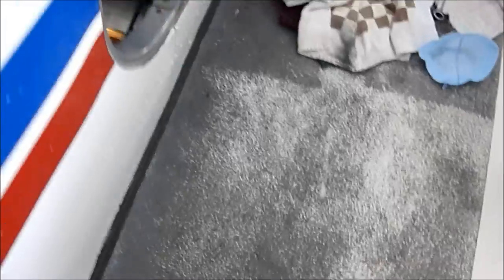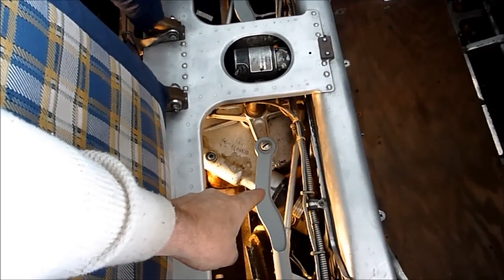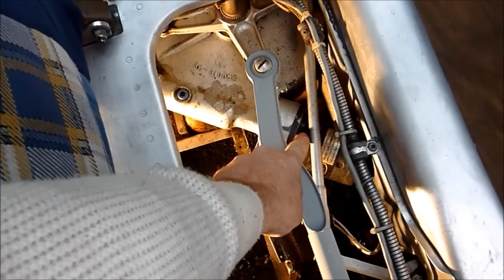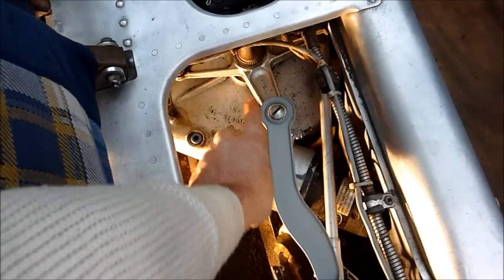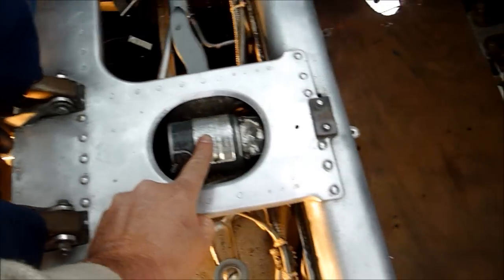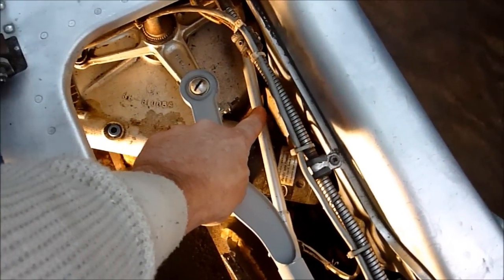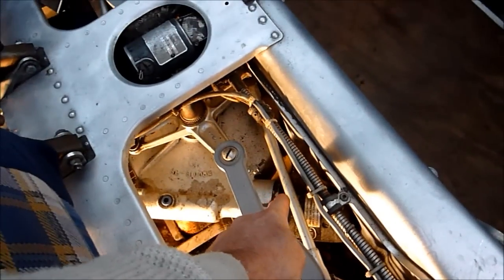Any time you're working on a plane on jacks, you want to be very careful when getting up and down off of the airplane. Underneath the front seats of the early model Bonanza is your gear retract mechanism. Here is the gear retract motor. Here is the gear retract mechanism housing. Here is the push rod for the right main landing gear, and here is the push rod for the left main landing gear. This is the motor for the electric flaps. Also associated with the gear is the mechanism to operate the landing gear doors — it's a well thought out, well designed system.